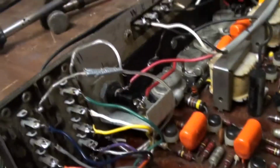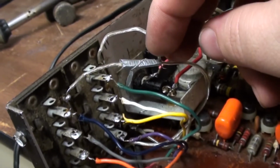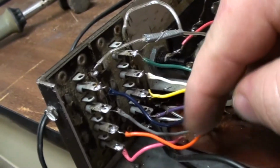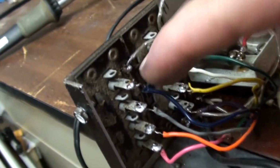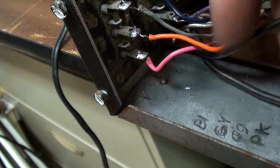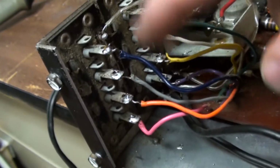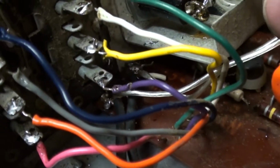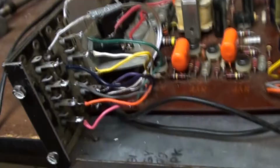One change I decided to do: the ground wires that were attached, I decided to solder these here instead, since they basically have these grounds attached to the wires that go straight down to the bottom of this thing, which is stupid. I changed it with this right here, so this is now soldered to the two wires sitting here on the bottom. They're coming up to this, and it doesn't really matter because they're both ground anyway, so they're touching each other.